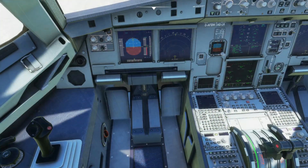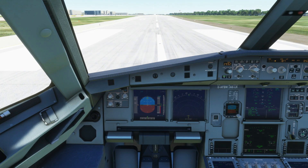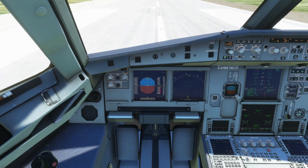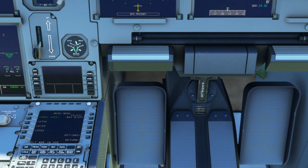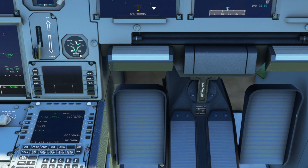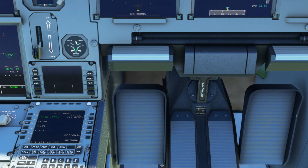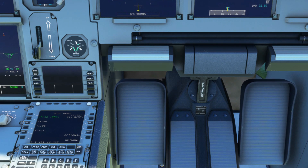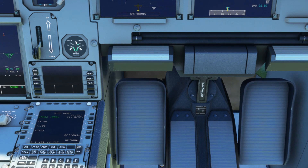The normal braking system is very simple. You apply pressure to the rudders to apply brakes, which is pressurized by the green hydraulics. You're probably asking yourself how do I know if I'm using green or yellow hydraulics. The answer requires you to look at the wheel page or at this little guy here — the brake and accumulator pressure indicator that determines whether you're using green or yellow hydraulics. If no indications are given and you successfully apply brake pressure to a full stop, you're using green hydraulics. If there's a pressure indication and you successfully apply brake pressure to a full stop, then you're using yellow hydraulics, which is the alternate braking system.